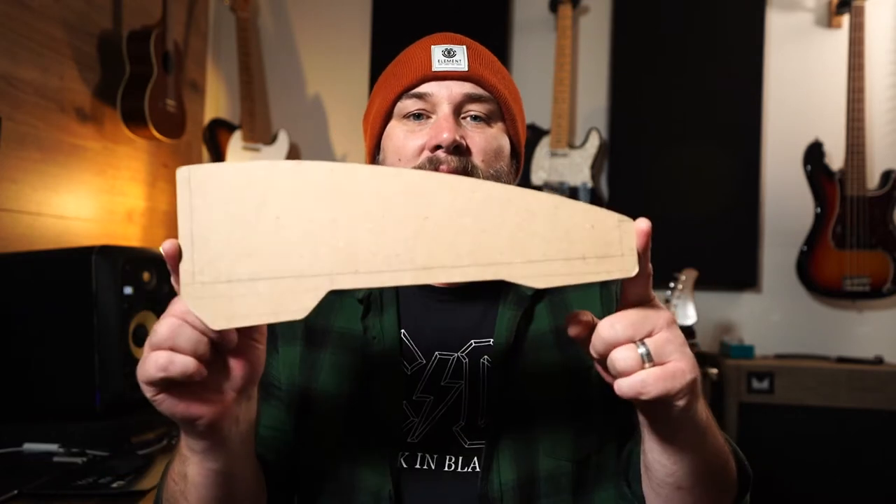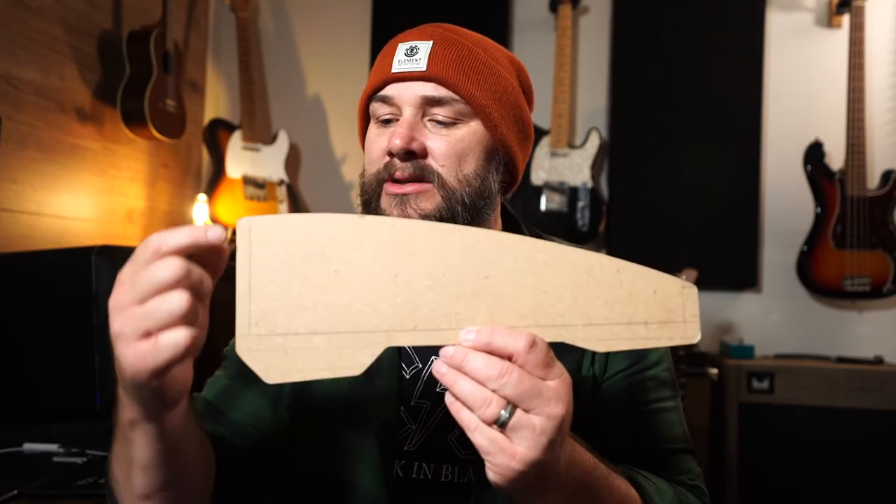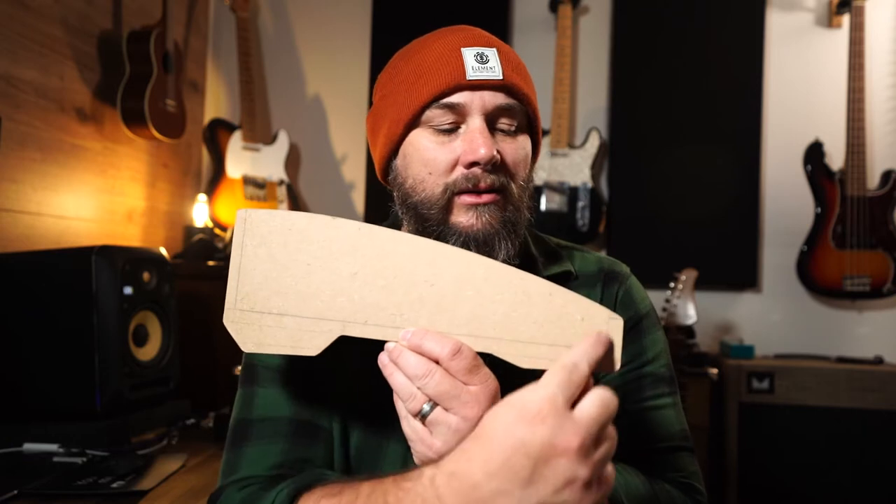The question I've been asked most about is how I got the curves on my board. What I did was use a template like this. Making the template is actually pretty easy. The most important measurements on your template are going to be the inside edges of your pedalboard — I've actually marked those lines in. This is what we're going to base all of our measurements for the slots, for the joins, for the backs and sides off, so it really needs to be accurate.